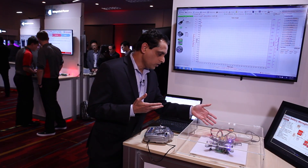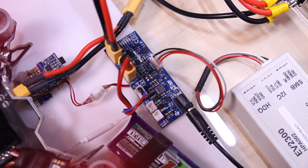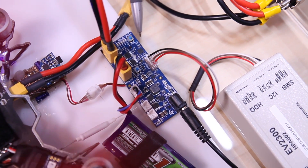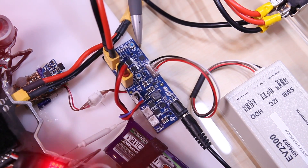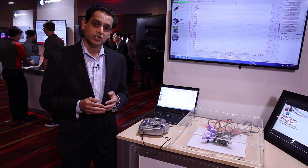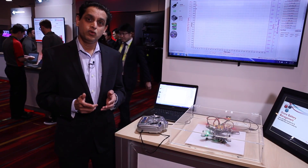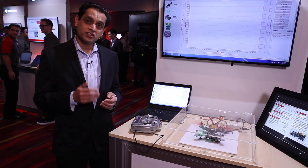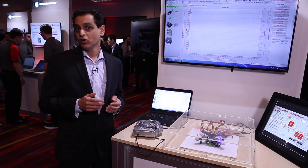What we have here is a small TI board called TIDA-00982. It features a TI fuel gauge called BQ4050. The BQ4050 is a 1-to-4 series cell fuel gauging and protection solution, based on TI's CEDV fuel gauging algorithm.